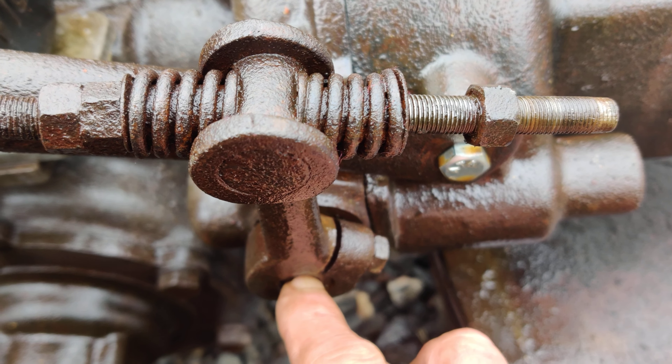I sprayed this bolt here — it does come out the other end. Let me get a half-inch socket and see if we can loosen that, then I'll push it forward a bit. If I break the bolt off in here I've got a spare — I used to carry one when I went snow plowing. I've broken those levers before; a lot of times they break if you over-tighten the clutch. They're made out of some kind of soft steel, not solid steel.